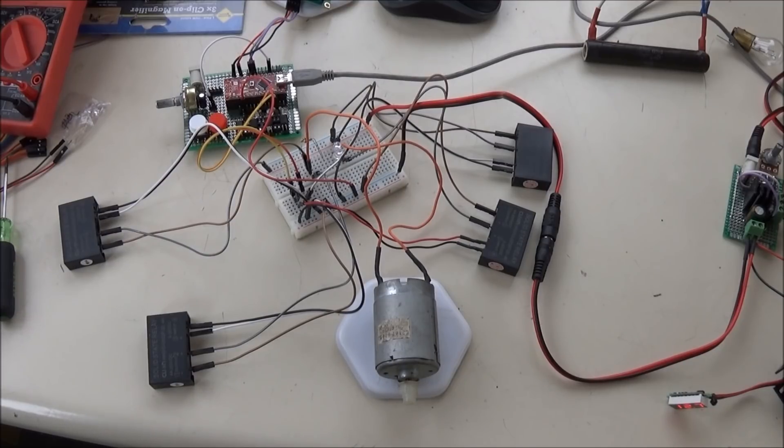It's fairly easy to hook up these modules. There are versions out there rated at over 200 volts at 25 amps — I think they're about five dollars each. With four of them, you could have a 200 volt, 25 amp H bridge.